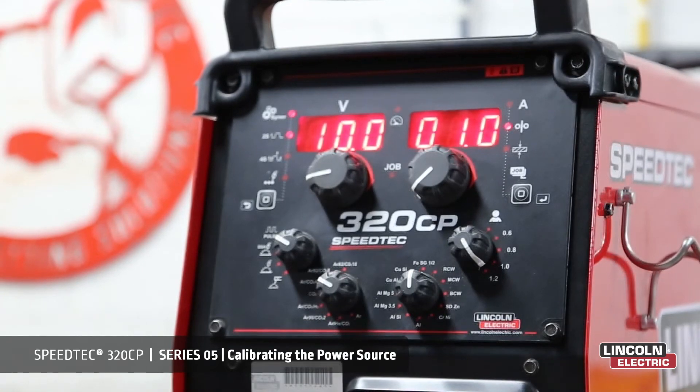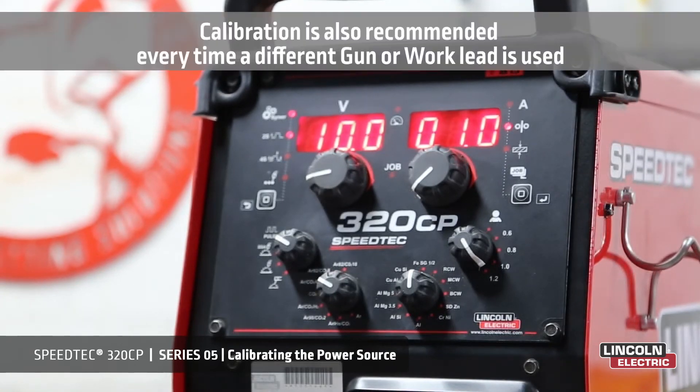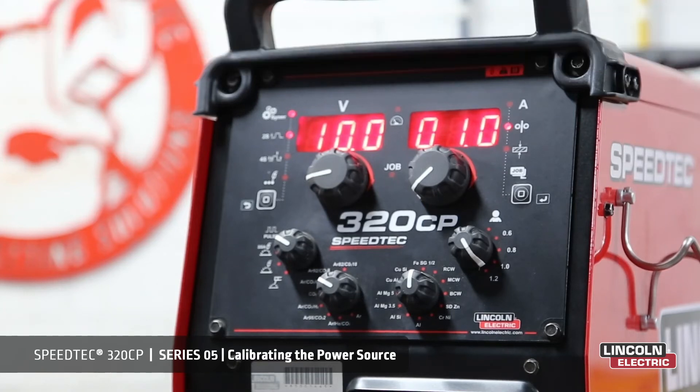If polarity is reversed, this step must be repeated. For cable compensation, you should not adjust them after calibration in most cases. But sometimes, if the welder is not comfortable with calibration or the results are incorrect, you can directly adjust them if the welding conditions are similar. This feature is really more suited for separate wire feed units if you need to adjust.